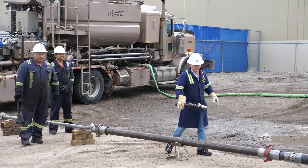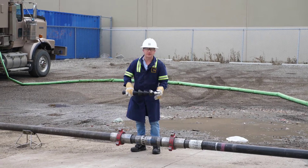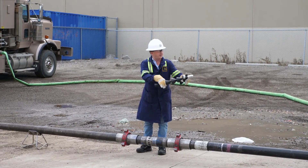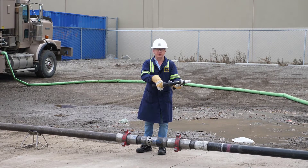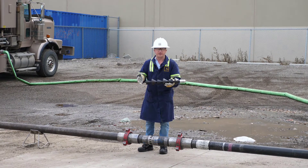It's going to go down this way here. Each one of our sleeves is set to open and shift with about 250 PSI of differential. We're going to pump this all the way through and retrieve the cement wiper dart at the tail end. The rate at which we're going to pump this through our fixture is about one cube a minute — probably plus or minus 25 liters a minute, so around a thousand liters a minute.